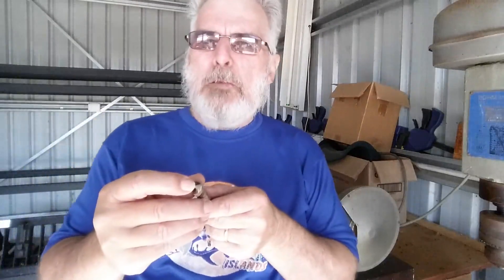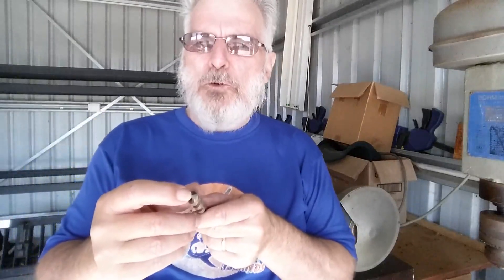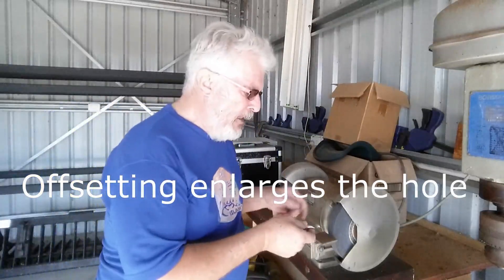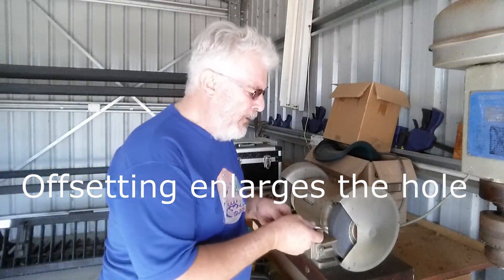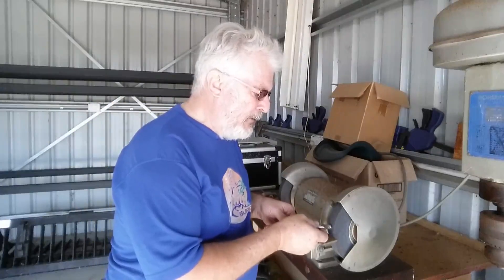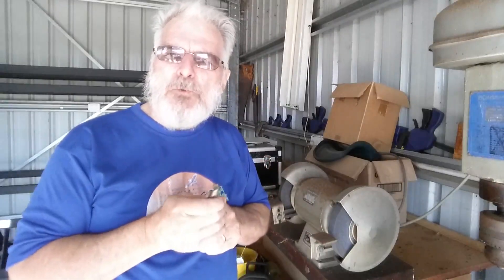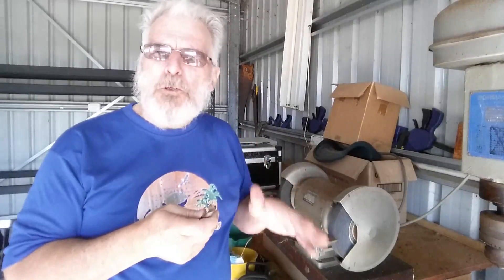The important thing is to get this flat piece in the center even, so make sure both sides are the same. Get the 60-degree angle on both sides — the cutting edge is horizontal above center — and stroke up. Let it cool slowly or cool it down manually, taking it very gently. Don't let it get hot; the grindstone will actually keep it cool if you just take a nice light cut.